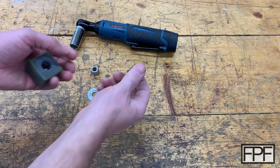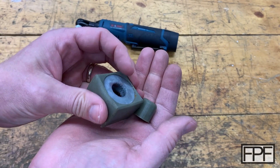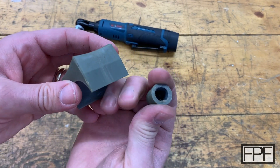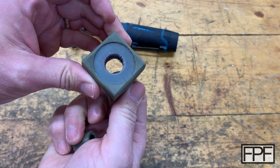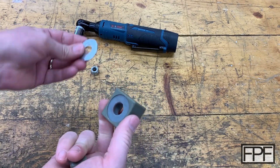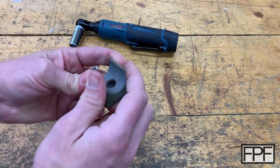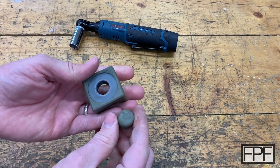So back on the bench, the two parts I've got here are 3D printed in TPU. And if they look a little worse for wear, it's because they've been outside in my yard in direct sunlight for almost four years. These are printed from TPU — TPU is a flexible filament. What's amazing is they still have their original durometer, they're still very flexible. Other than the little bit of fading, they're still incredibly tough. I'm really impressed with how TPU has held up outdoors.